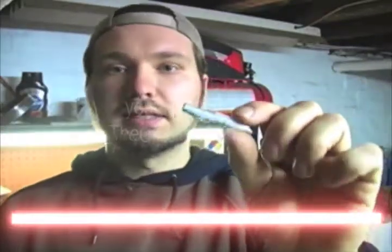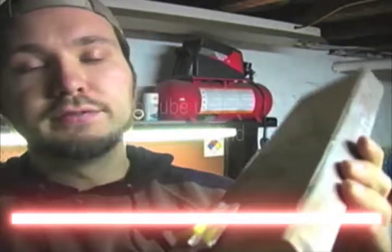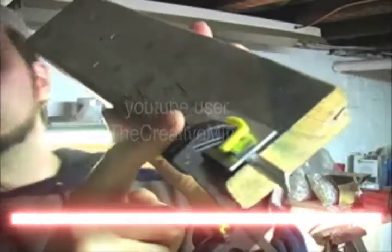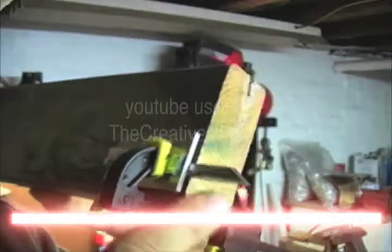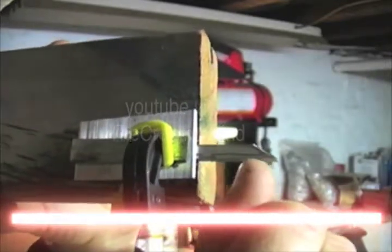The one setup that I have used is a 2x4, a small plastic hobby clamp, and the leftover aluminum chunks, which I've used as heat sinks. Now when trimming aluminum, obviously you are going to get heat, and underneath my aluminum pieces I have one of the aluminum fins. Being that the fin is held in place really well, I'm going to take my Dremel tool and the wheel and start forming out the bottom of this up to my black line.